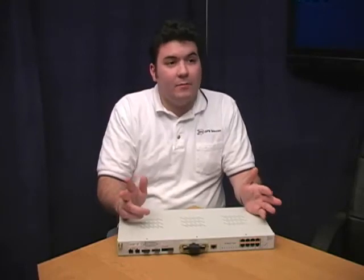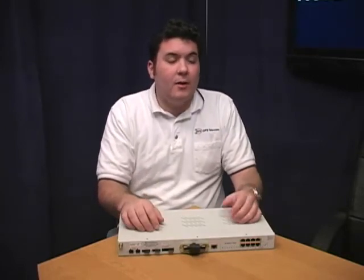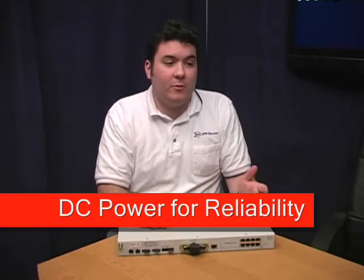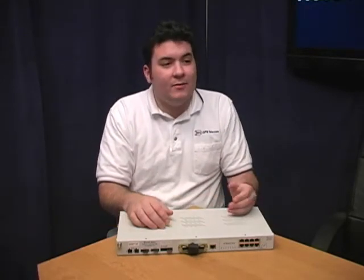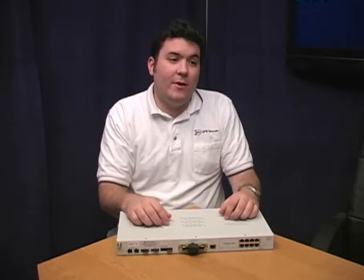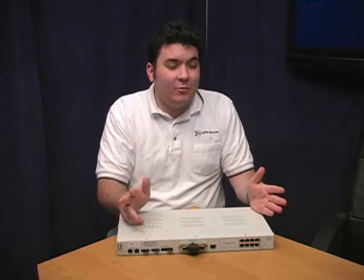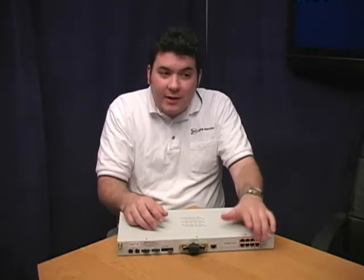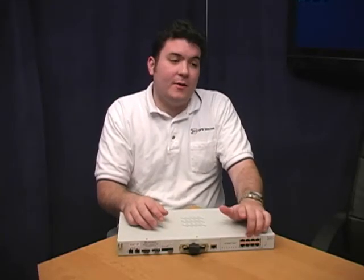And even if you bought one of those LAN cards, wouldn't you have to buy a separate switch? Yeah, that's absolutely right. And it probably wouldn't be DC powered. To protect your uptime, you really need to go with DC power. Otherwise, your switch is going to go down with commercial AC. When that happens, even though your RTU is still running off your battery plant, who cares if it can't get through the switch to report alarms? It may as well be dead too. With the integrated LAN hub, you won't ever have to worry about that problem.